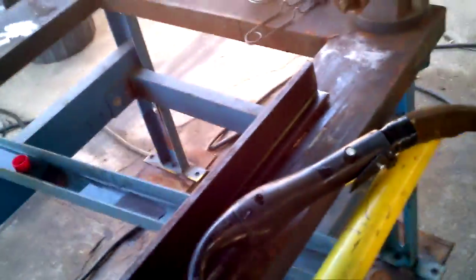You can have the 110 running off the box there to power the box separately. The gun is an old Cobra Gooseneck. I put a heavy-duty — this is usually for aluminum pulse welding and aluminum welding. Actually, the box is primarily designed to MIG weld aluminum. I'm running .045 wire mild steel through it and I'm going to attempt about a yard-long fillet weld here.